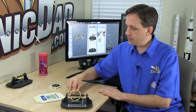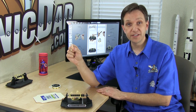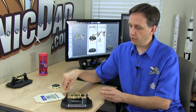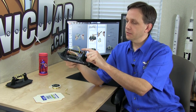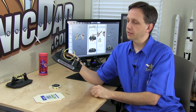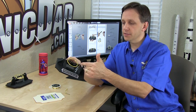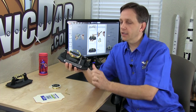The other important thing on a DC motor are the brushes and the commutator. For the brushes, I use a brass paper brad — this is actually brass-plated steel, but it works just fine. You take some heavy-duty shears, cut the legs off, and they become great little brushes for your motor. I install those inside a ballpoint pen spring, which gives you just enough spring preload for making contact with your commutator. For the commutator, I bring the ends of the coil across the dowel, hold them in place with a couple of o-rings, position them so the timing's right, then scrape off the non-conductive coating with an exacto knife — and that becomes your commutator.